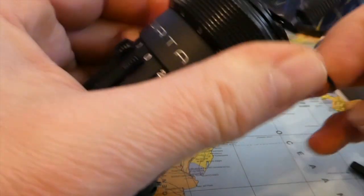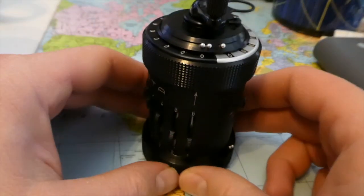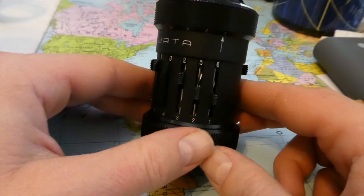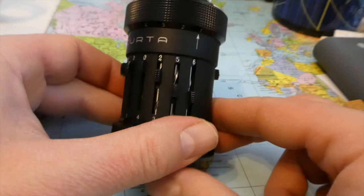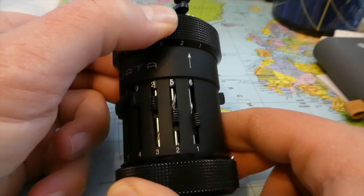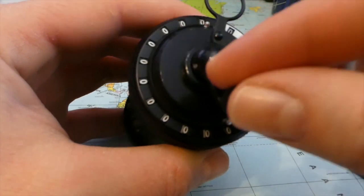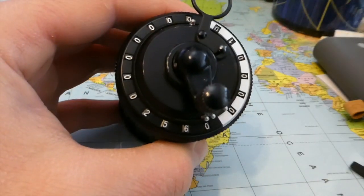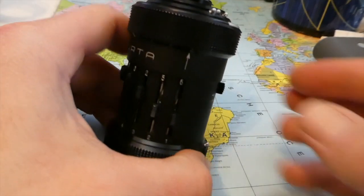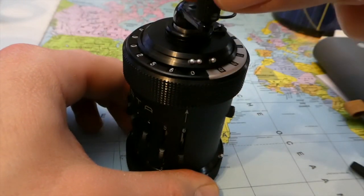Let's do a reset. And if you want to multiply by 10, you could actually turn the handle 10 times, or just move the carriage position to the next position. So with one turn, it's multiplied by 10. Then you move the carriage position back to one and decrement it by one.